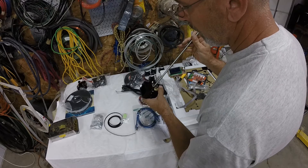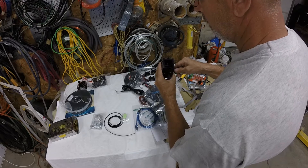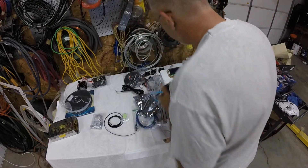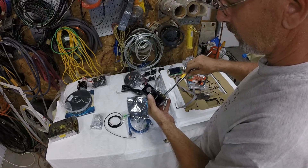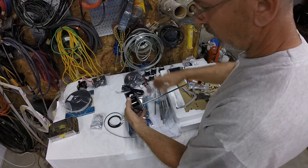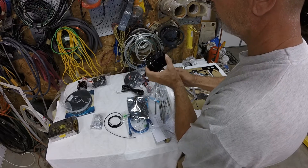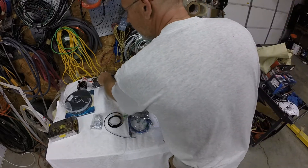See how these bearings fit - there's a little bit of slop in there, I'm going to have to put some preload on this. The other thing I'm going to do before I even start putting this together is run these rods on a flat surface to see if they're bent and straighten them out if I have to. This is put together and looks pretty good - I'm going to double check and make sure everything's nice and tight. I got another one just like it.